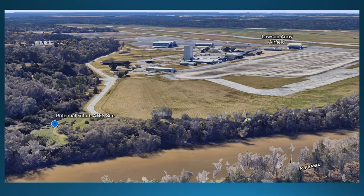Now we are going to start to go through the steps to construct an ATES system. First and foremost, you will need a suitable site to install your ATES system. With an ATES system you will need an aquifer capable of producing the water flow needed to meet the capacity of the building or buildings it is supplying. Preferably the aquifer is anoxic and unconsolidated or made up of coarse limestone. Other aquifers can be used but may present additional design challenges.